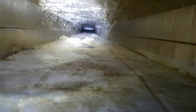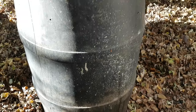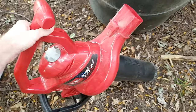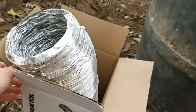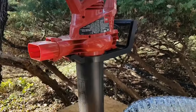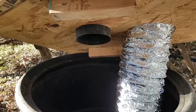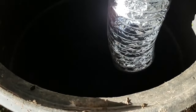Most of the work was done with a homemade vacuum and duct whip. I used a barrel, a leaf blower, a piece of OSB sheeting, and some flexible foil ducting to make the vacuum. One end of the foil ducting goes through a hole in the OSB sheet and into the barrel; the other end is attached to a certain vent inside the house. A trash can or a fairly large storage tote could also work in place of the barrel, as long as the lid seals okay, but it has to be sturdy enough not to collapse from the strong vacuum.